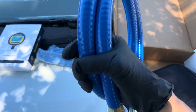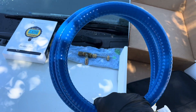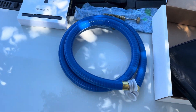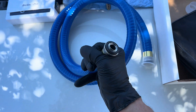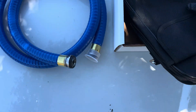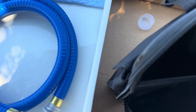This is your three-quarter inch hose. This is for vacuum only — it never gets refrigerant or oil, and is never contaminated with it. It's only meant for vacuum. It's best used on four-port manifolds, but you can use it on three ports with adapters, because on the four-port manifold you have a big port — and you come with adapters that will get you hooked up.